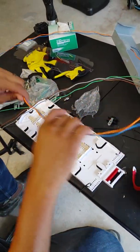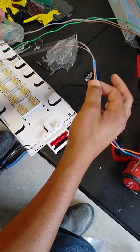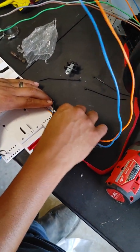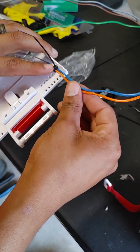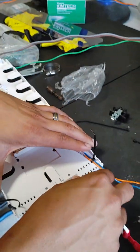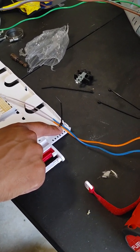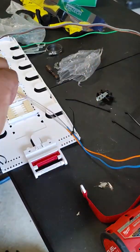Now I have my input side set. You always start from the outside in, so between blue and orange, blue is first — make sure that's on the outside when you put these in. With felt, this won't move. You can see some white marks right here — that is from the buffers being pinched. If you don't prep a cable correctly you're going to get this. If you open a cable correctly and you still see this, you need to test it because it might be bad — that means it was pulled too hard.